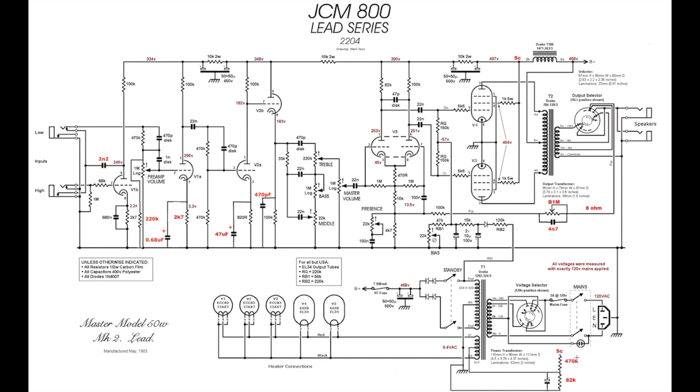And then down here, this is our elevated DC heaters. We've seen this before if you followed the channel. It's an age-old trick that does wonders for reducing the noise in an amp like this, where you've got traditional AC heaters, 6.3 or 6.4 volt AC heaters, powering the heater filaments on the five tubes, I should say. Normally that center tap is just set to ground. What we're doing here is removing the center tap from ground, and we're creating a DC reference voltage.